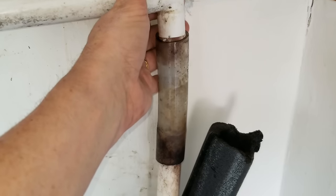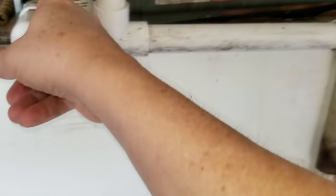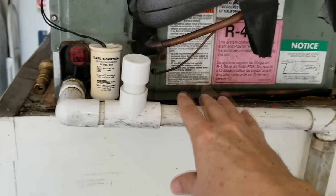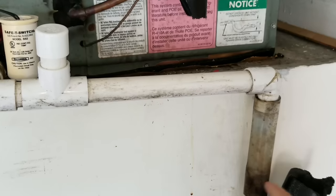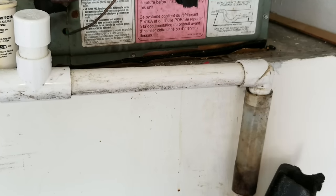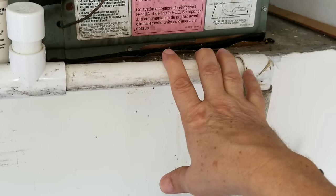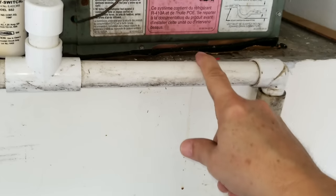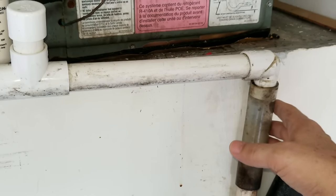Now we're going to put this back in here. You can see the water is flowing a little bit — it's coming out of the drain line because now I've got it running downhill at a slope, which is required to make the water move down. By the way, most modern codes for air conditioners require a trap right here. In this case it just runs outside, but if this were in a condominium building you'd be in trouble because they usually run down inside walls into the sewer system. Sewer gases or gases from another unit could come back up, so the trap keeps water in there so gases on one side never make it back the other way.